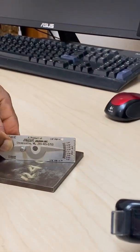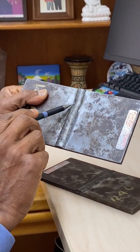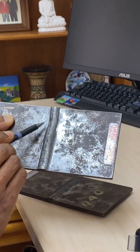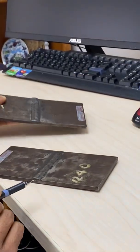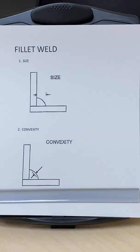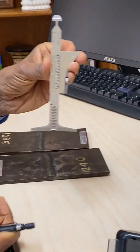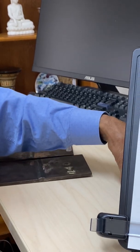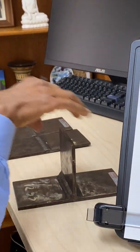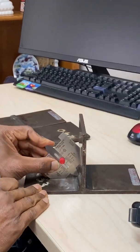This one is underfill — incomplete weld — clearly not acceptable. You can see the difference between underfill or insufficient weld compared to undercut, which is in the parent metal. There is another gauge called the high-low gauge, which is used in the field. There are also gauges for measuring the throat — this one is another example of taking the measurement of the throat or convexity of the weld.